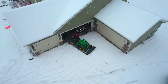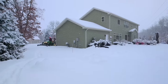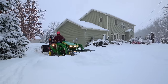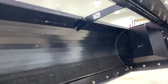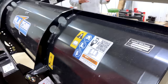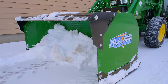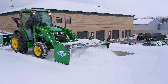With a snow pusher you don't have to do that — there's no bottom to trap snow. With the HLA design specifically, the back is radiused and rolled, which helps the snow roll forward and continuously maintain momentum as you're pushing along. The snow isn't just sitting there stuck because the design keeps it moving forward, getting it to where you need to go as quickly and efficiently as possible, with less work for the tractor — and then it releases without any shaking or adjustments needed.